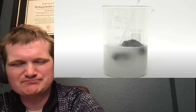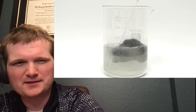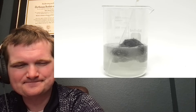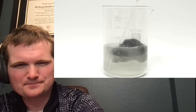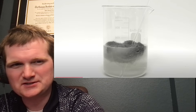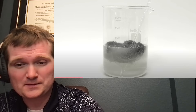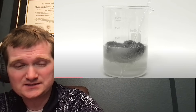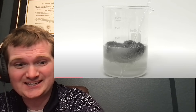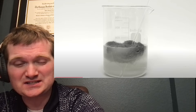Hopefully he's doing this under a fume hood — he probably is, he's pretty well set up. Throughout this reaction, a decent amount of hydrogen gas is going to be generated, so it's important to do it in a well-ventilated area where it can't build up. Battery rooms for backup systems in nuclear power plants are well-ventilated — they're indoors and well-protected, and they each have their own dedicated exhaust fan for the room, because they also have the potential to release hydrogen gas.